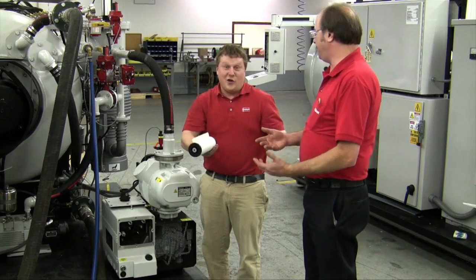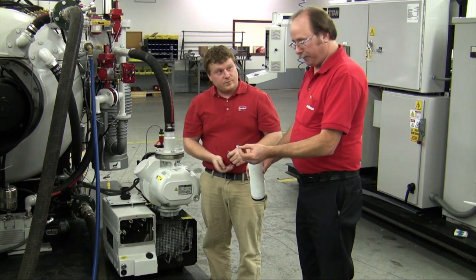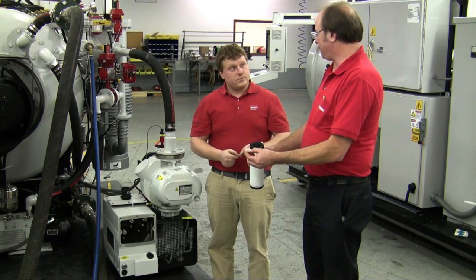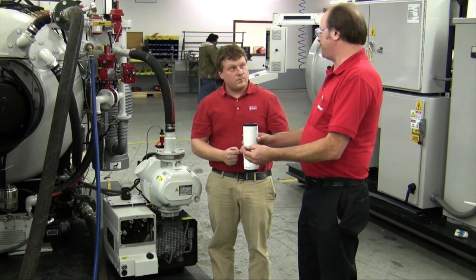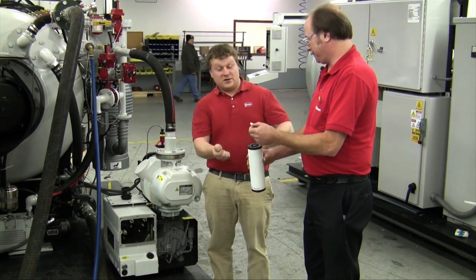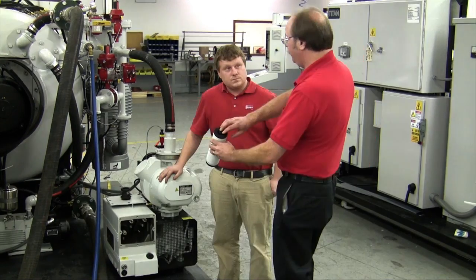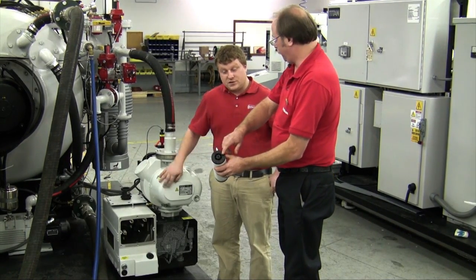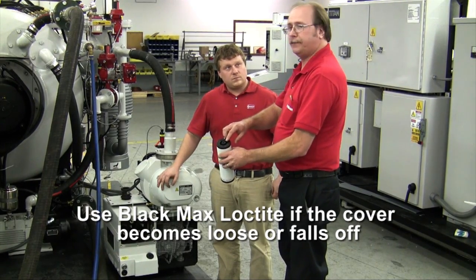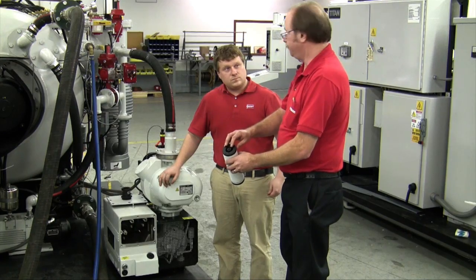You can see it's pretty clean — this is basically a brand new pump. There's a little bit of spring hardware. You always want to make sure that you do not lose the fender washers. If you lose one, do not use a standard washer with a smaller washer — with smaller washers, they leak. You'll see smoke, which is oil mist, get by the filter. Keep track of these fender washers; if not, replace them with new fender washers. If you install a new filter and you still get oil in the line, maybe the washer was forgotten or it's the wrong size. You also don't want the gasket to become unglued from the exhaust filter. If it does get pushed off, use what we call Black Max Loctite — basically similar to super glue — to glue it back on. This gasket must be glued in place for it to work effectively; otherwise it short-circuits the filter and you get smoke outside the pump.